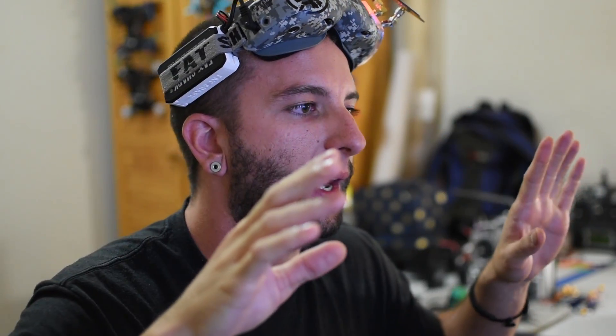Today I'm gonna show you how, with the new version of Betaflight, to actually use your flight controller and your remote controller to change the settings of your camera — something you install permanently in your quad so you're never in trouble again when you want to change camera settings. I'll quickly show how it works by recording the DVR, then we'll go to the bench to wire it up on a RunCam and a traditional HS-1177, and then we'll go into Betaflight and I'll show you the CLI commands to enable this feature.